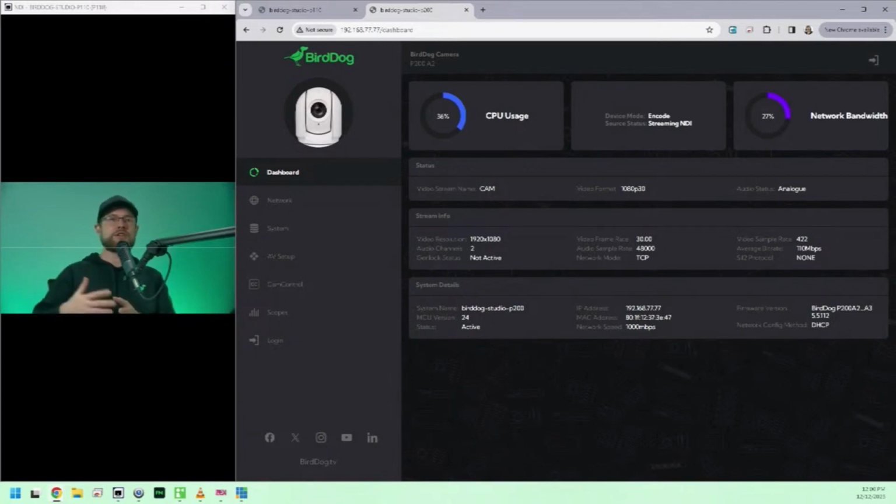It's going to function great anywhere under 700 megs, okay? It's not going to be able to function at 1 gig indefinitely forever. And so if you're connecting multiple studio monitors over TCP with this camera, it's going to load up that bandwidth pretty fast. But if you're running a multicast or something like that, you won't really have to worry about that.